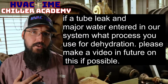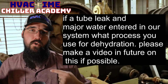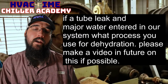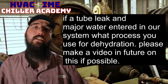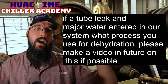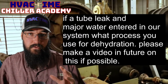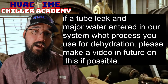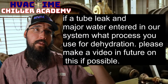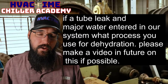I personally am a huge fan of a nitrogen purge. This is something where you set your tanks up, you get a trickle purge going, and you flow through the whole machine into the condenser. I usually go into the top of the condenser and then open my liquid charging point at the bottom of the evaporator, or I'll do vice versa, let it come back out the top of the condenser. It just depends on the circumstances. But by doing a very slow trickle purge, almost like a brazing purge type of CFM, it's not a whole lot, but you do that for several hours with a tall 300 cubic foot tank, and that'll do a huge service to getting that machine really dehydrated, in addition to pulling an evacuation.